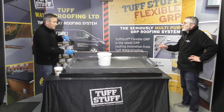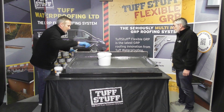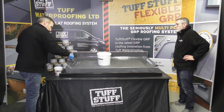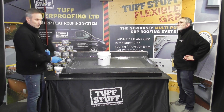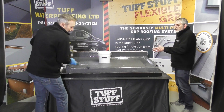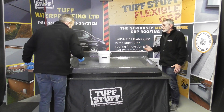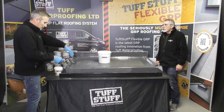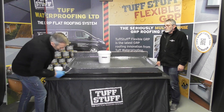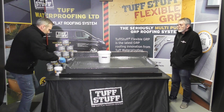For some reason this does not seem to want to slump the way that other liquids do — it's thixotropic, more thixotropic than you would see with a standard resin or topcoat. So doing vertical surfaces with the whole system is not a problem. With other systems you might put it on the wall, walk away, and find it on the floor, but with this it stays for days. Working my way around the perimeter now — the beauty of this is, if you get it on and think it's a little bit thick, you can lay it off almost like a paint. It's very, very forgiving. If you get any splashes, just wipe them out, because if they cure they'll leave unsightly drip marks. My roller is starting to work really lovely — I'm getting nice thick coats down onto the edges now.